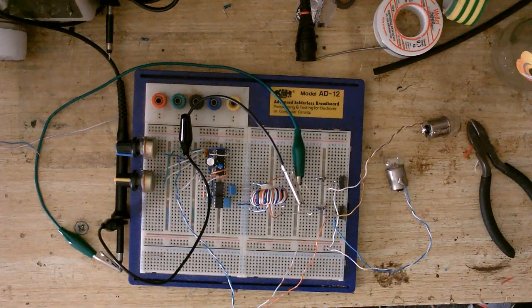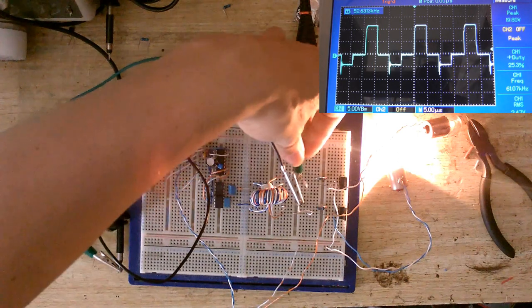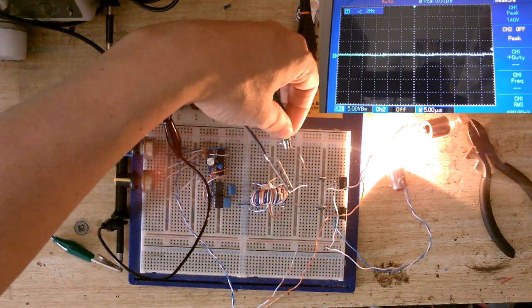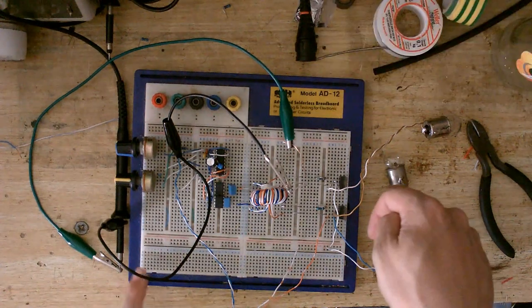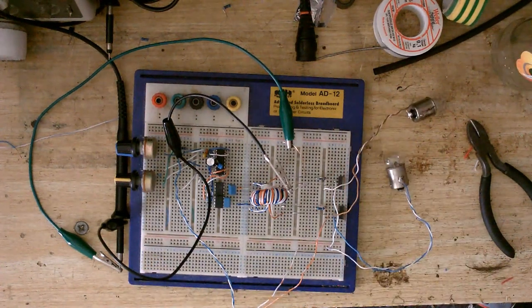This hasn't gone so well. If I turn the power on you can clearly see one bulb is brighter than the other. If we look at the waveform at the lower MOSFET and then see what the upper MOSFET's doing — yeah, you can see we've got a very imbalanced wave there. I'm pretty sure that upper MOSFET might be getting pretty toasty — it's cold. That one's a little bit warm, but yeah, back to the drawing board I think.